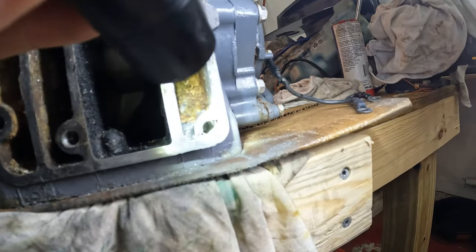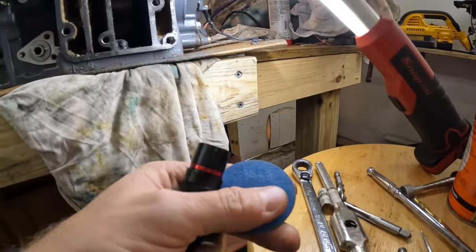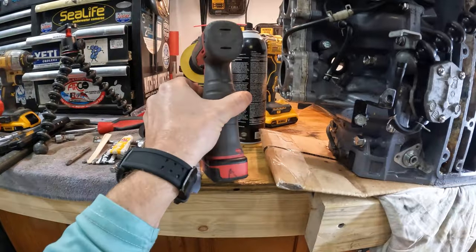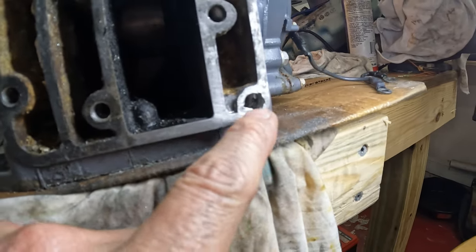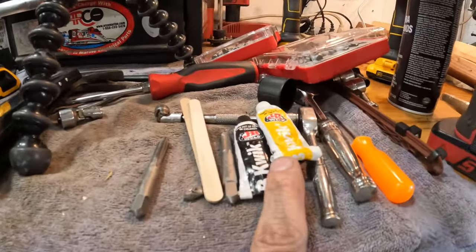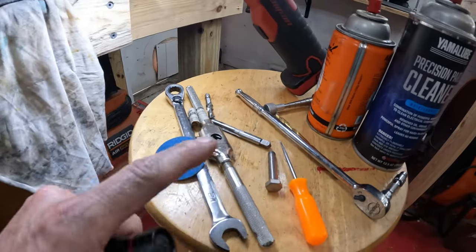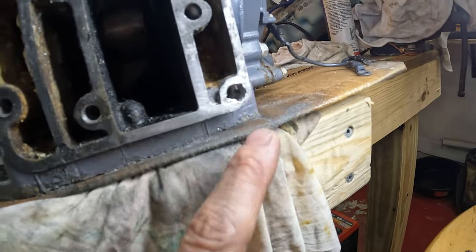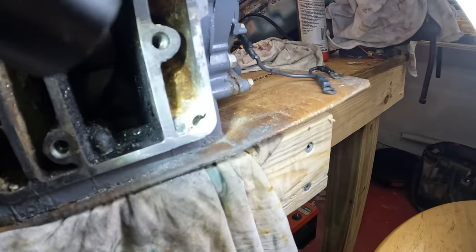We are looking really, really good — that thing looks actually phenomenal for what it is. I just used a little 120 sanding pad as well as a 3M roll lock bristle tip to kind of polish this up, got that cleaned off and ran down contact cleaner to clean everything up. I got that all scratched up and now I am ready to go ahead and use the trusty old popsicle sticks, some JB Weld, mix it up, and basically I'm going to coat the bolt. I'm going to coat it in the JB Weld and run it through there and let that JB Weld pack all around the inside where all the threads are — just along the side of the bolt, not on the end. So let me show you that and we will go ahead and get the JB Weld on here to let that set overnight.